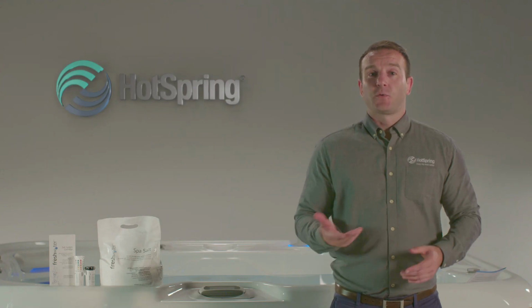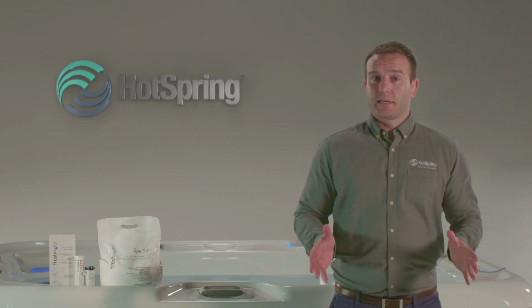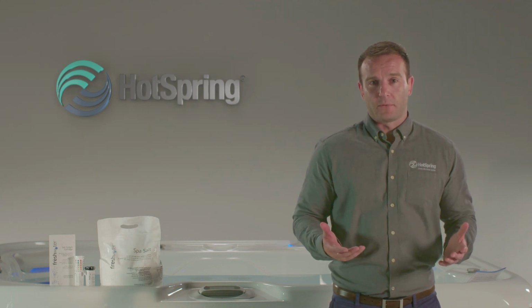It may take up to 24 hours for the system to be working most efficiently. Good news is, it'll generally coincide with the time that it takes to heat up your spa pool, depending on its size. When you come back to the spa about 24 hours later, dip a test strip to ensure that the pH and alkalinity are within the OK ranges, and make sure the hardness of the water is now between 25 and 75 parts per million.